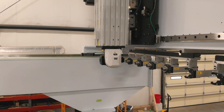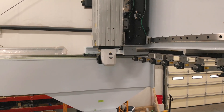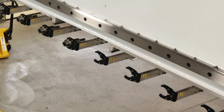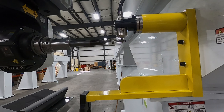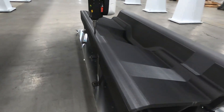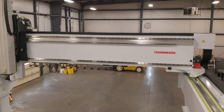The MAX-5 is equipped with a six-position automatic tool changer as standard, or with optional 12 tooling positions as shown, conveniently mounted under the gantry for quick and efficient tool swaps, handling tools up to four inches in diameter. 15-foot wide models can also have up to 18 tooling positions. It also features a high-tolerance tool length sensor to automatically measure both the length and diameter of your tools and update the control system with the precise offset numbers.